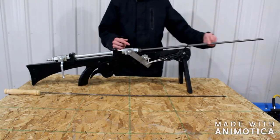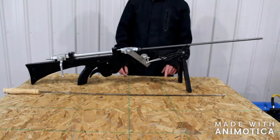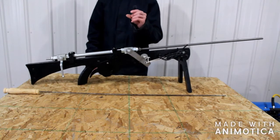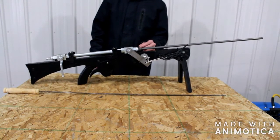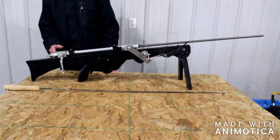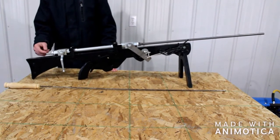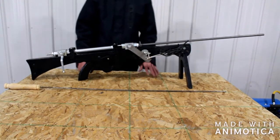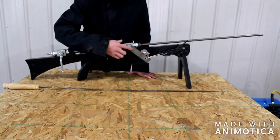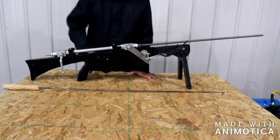And this is my barrel, as you can see. And it's a quarter inch. Right here I welded on a really super short half-inch threaded piece of some sort that works beautifully. And right here I got a half-inch to quarter-inch reducer and that's a standard air compressor fitting. And as you may have noticed, this handle is the original one, and I mounted a different one in here.